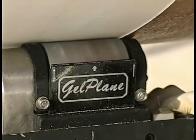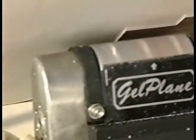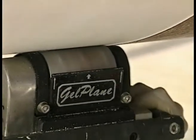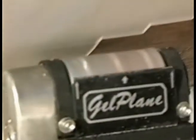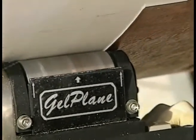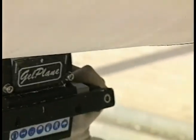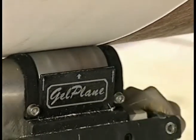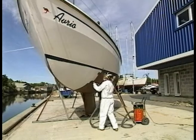The level nose plate must always be held on a cut surface while the offset nose plate is always on an unmachined surface. Whilst peeling it's recommended that a series of short strips are cut to avoid overreaching and repeated changes in body position. If consecutive strips are stepped then following cuts can be picked up with the offset nose plate resting on an uncut surface. It's also important to limit the width of cut to approximately half the drum as this ensures a clean fast cut with minimum effort.